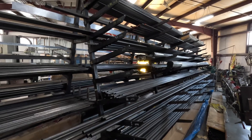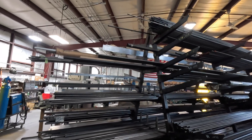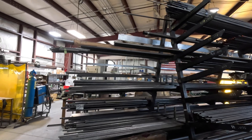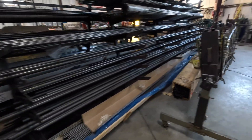The 4130 is all sourced out of U.S. mills. Some of the mills aren't supplying some of the smaller diameter tubing, so we do get some tubing from Europe — out of Italy or Germany. We don't get any from the Asia side of the market. We've found that the metallurgy on that metal isn't quite up to snuff with what we like. So we stay with U.S. manufacturing products as much as we can, but some mills are just not making the small diameter tubing anymore.